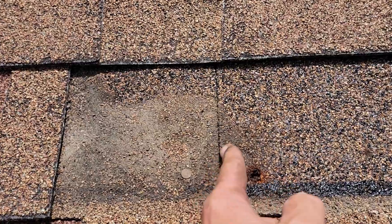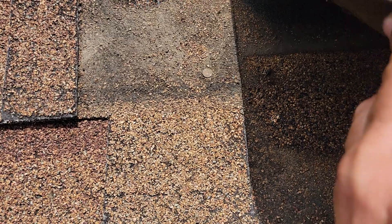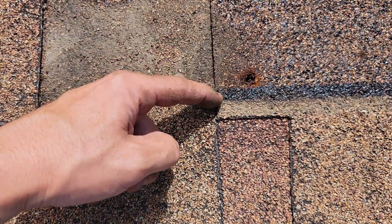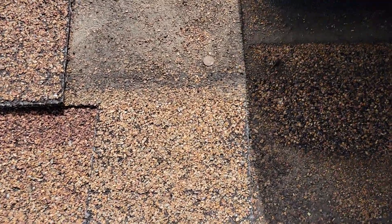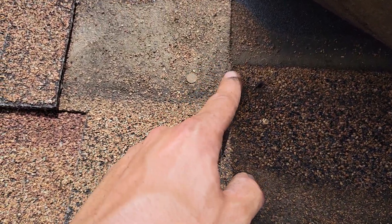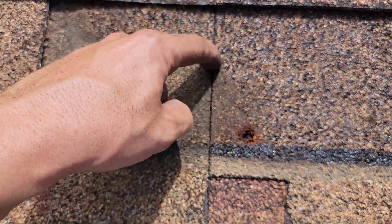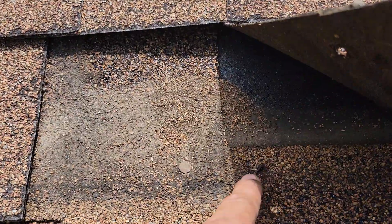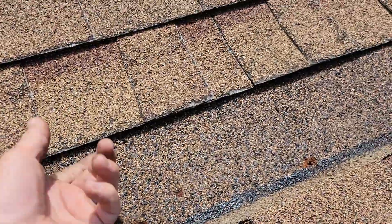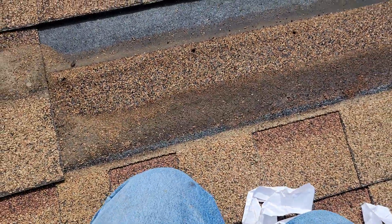The keyway, however, is more important. Water coming over to the keyway — the shingle under it I've already got loose. You can see it only goes up so high, so if water gets on right here or wicks back up under it, it's on the shingle below it. Provided it's installed correctly — no nails in the keyway, no offset too close — it will run out. But with this coming in this badly, this high, it's actually missing the shingle below it. Let's pull this out. There are a couple nails in it — we're going to replace those two.